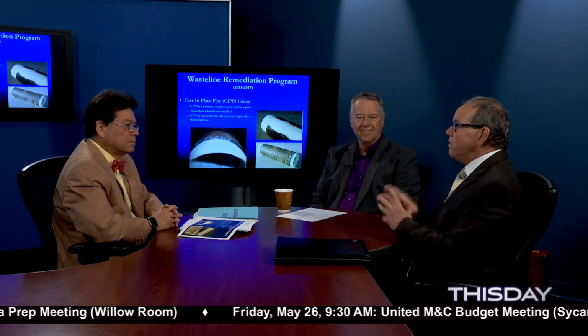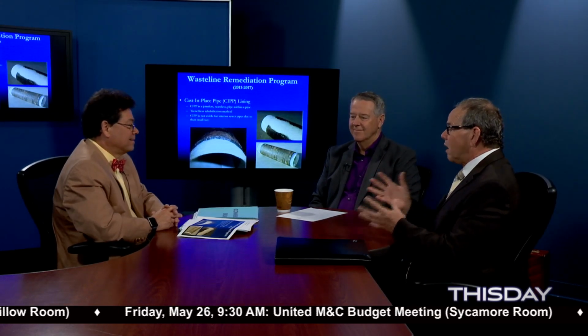The interruption to their service will probably be 1 to 2 days, but intermittent, and they'll still be allowed to use their fixtures. They just need to communicate with the contractor. Okay. But they will have their fixtures available to them, and it should take 1 to 2 days. However, the work actually takes a couple weeks because the contractor needs to go out there, evaluate the building, see what the accessibility is, TV the lines, and make sure they understand what their condition is. So the process starts about 2 to 3 weeks ahead, but the impact to the resident is 1 to 2 days. Okay. And like I said, it's intermittent, so they're not going to be without their fixtures for any long period of time.